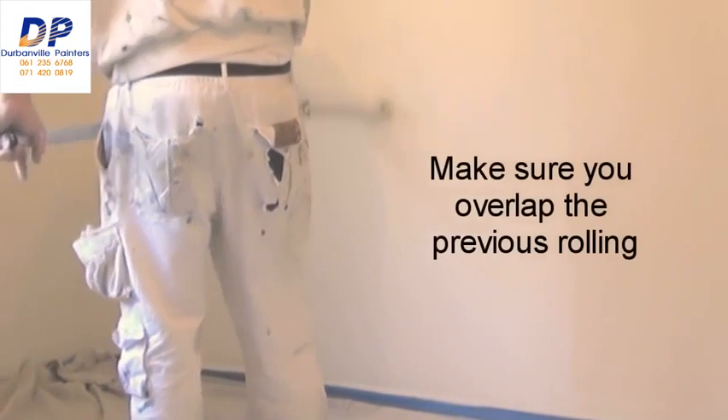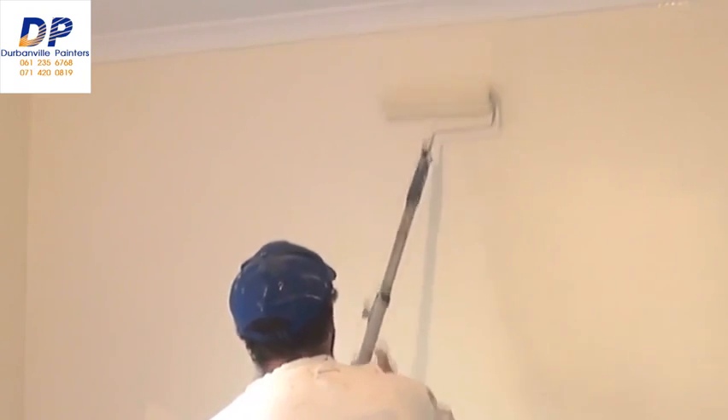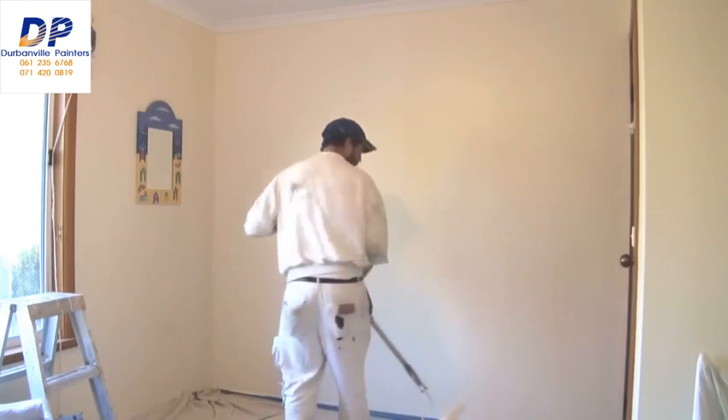Each time you do that you're not worried about hitting the corners. If you start at the top and roll down, you've always got to worry that you're going to hit the corners each time you put the roller on the wall.